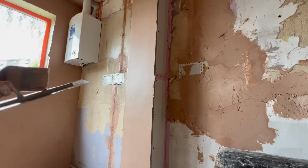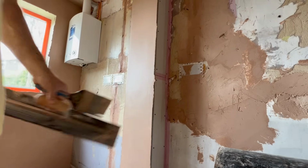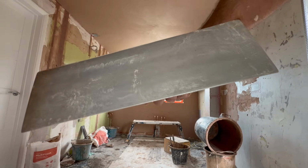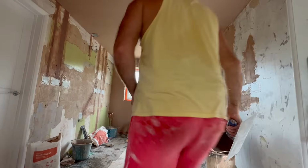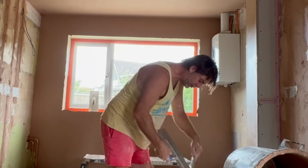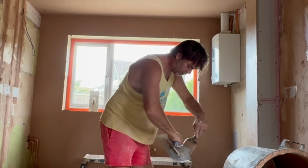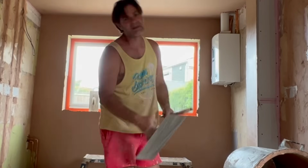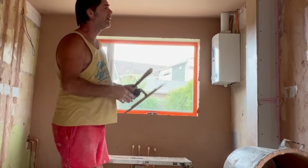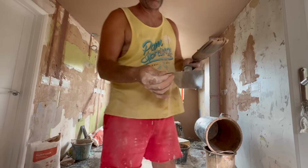Right, let's start again. I think what I'm going to do now is switch down to my Rafina Flex 2 stainless steel 16-inch. Use this other than the 20, because the 20 is a little bit hard on your shoulders and everything. Plus this closes the surface in, so that bigger trowel's dealt with a lot of flatness, making sure everything's all straight. That is why I can now drop down to something flexible like this, okay? And it's a softer metal.